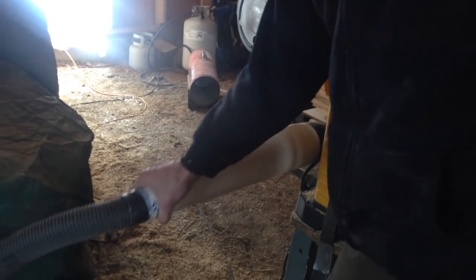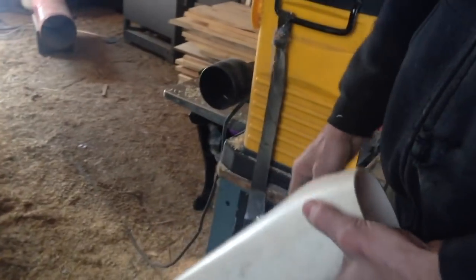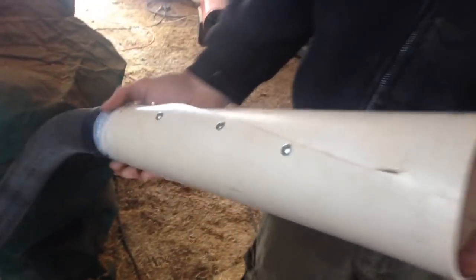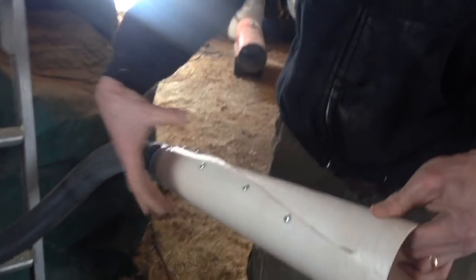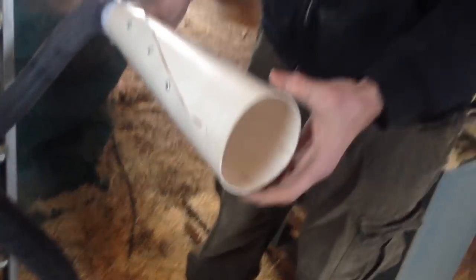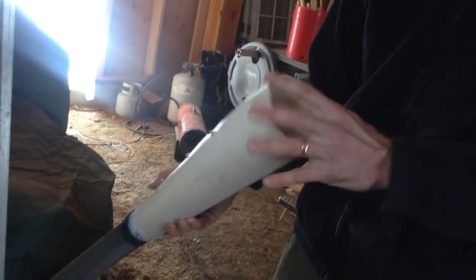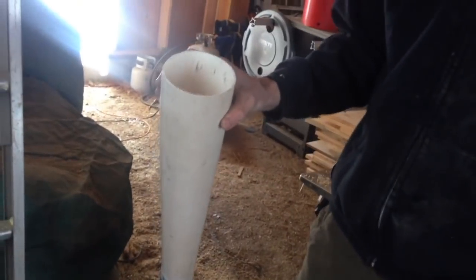One thing that I made long ago is the adapter to go from the 4-inch port on the planer — a lot of large power tools have a 4-inch port like that — down to the 2-inch hose. I had this piece of 4-inch thin-wall PVC, made a split in it, and clamped it down and shot some screws into it to make that cone. It's not elegant exactly, but it sure makes that transition. When you're making a transition like this, you want to make it kind of long — any sudden changes in size create a lot of drag and places for dust to get clogged up.